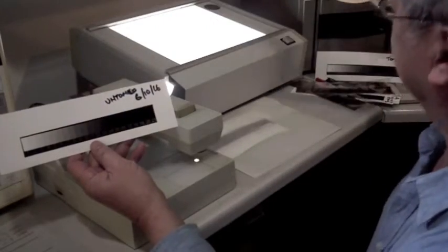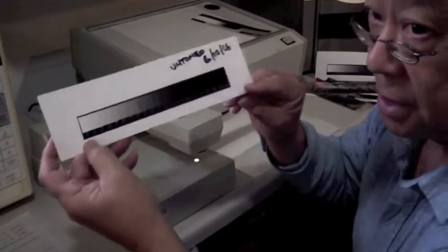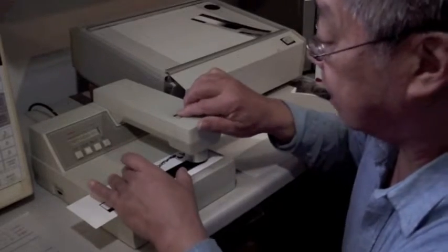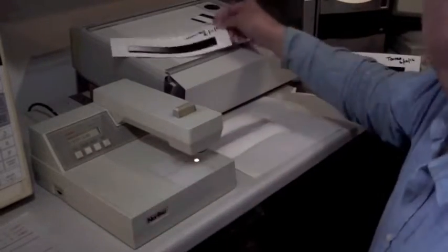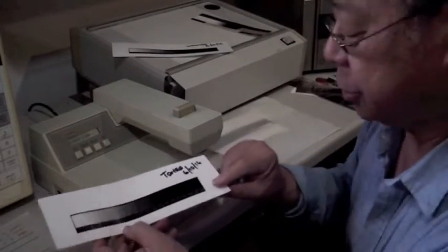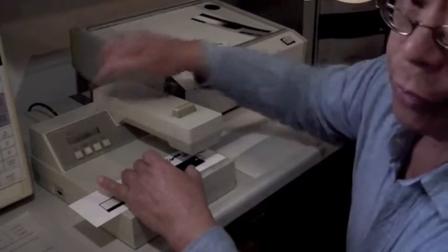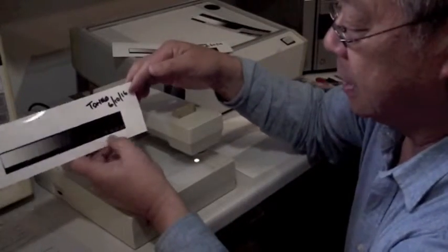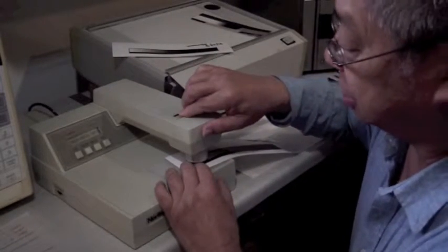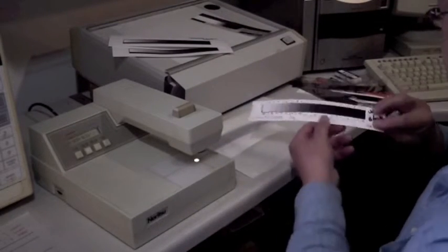Now, let's take a look at the maximum black I can get on. This is, again, multi-grade paper, untoned. Okay, so I'm getting a maximum black of 2.08. The same paper with the same exposure and development achieved 2.23. So toning it gives me a much stronger black. The white is unchanged. Same. It's 0.11. This is the Ilford